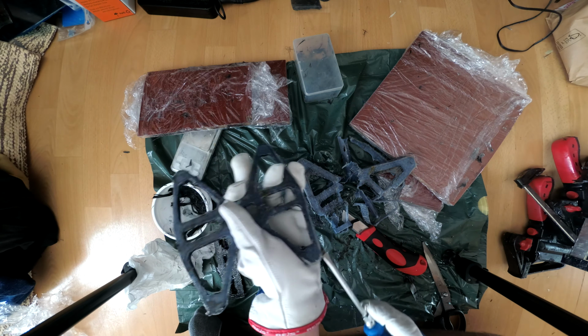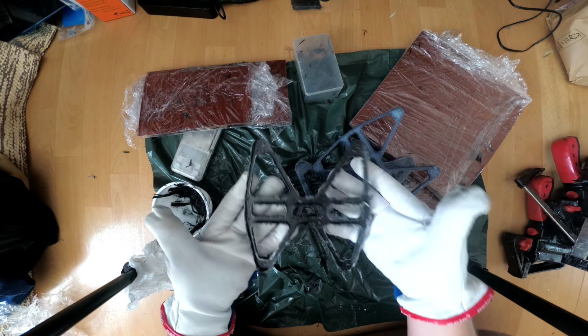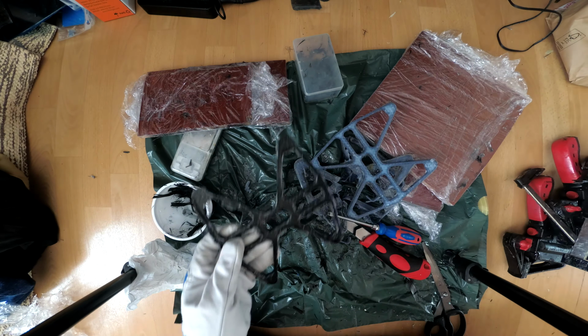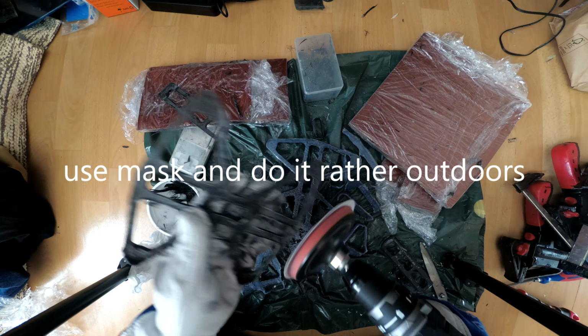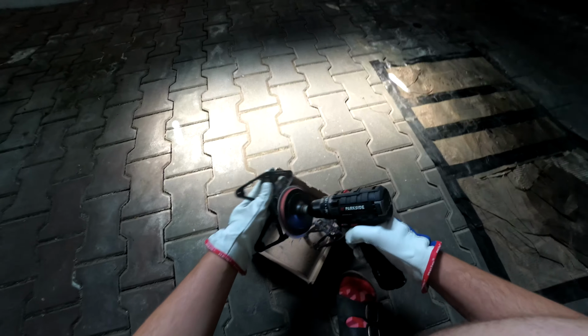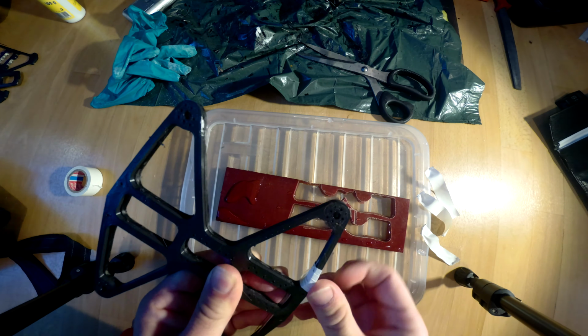Step 8. Extract the carbon fiber from the mold by using force and any possible sharp object you have. Step 9. Clean the overspilled edges and sand the whole frame as you like. Step 10. Print a drilling stencil and stick it on the frame.